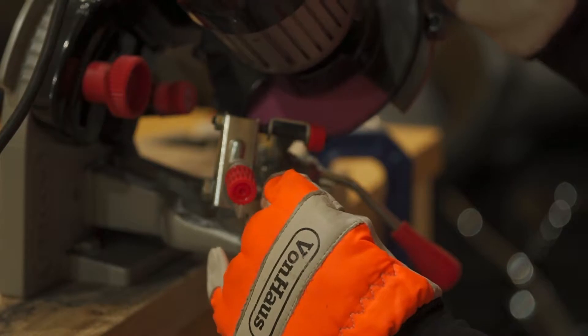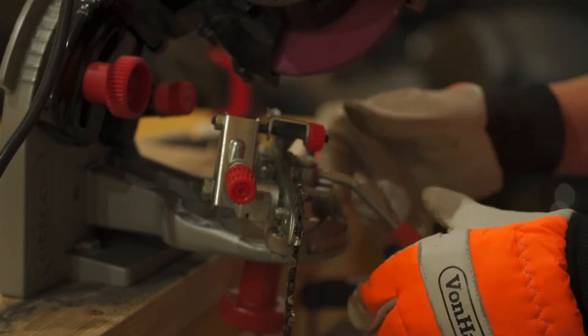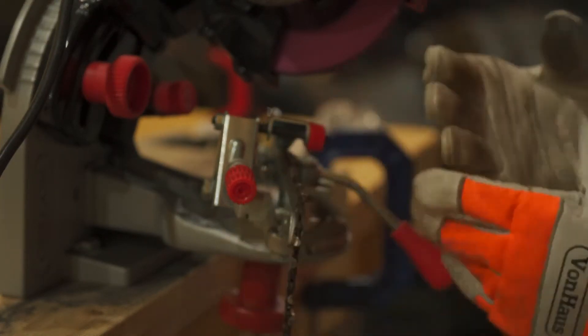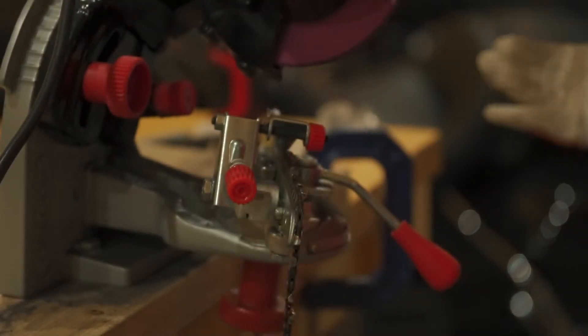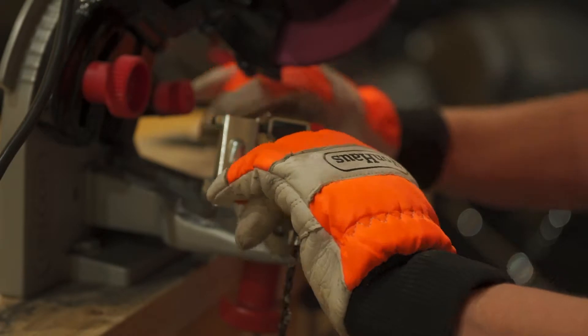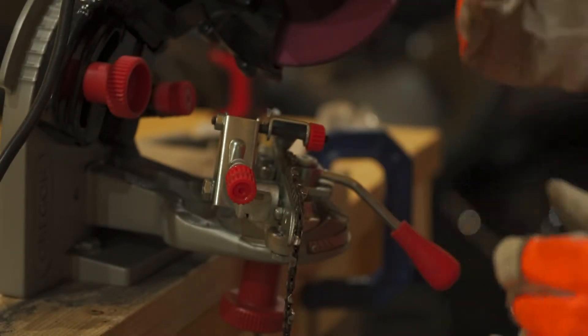Line it up. Make sure this is tilted to the degree you want to be able to cut the inside of the tooth, and make sure your angle is right for the tooth itself. I pretty much standard use 30 degrees, and then I tilt — for this back tooth, I tilt towards me — and it gives me a nice inside edge.